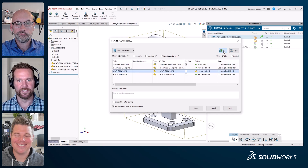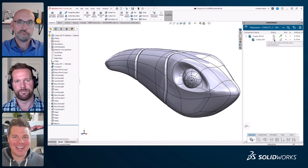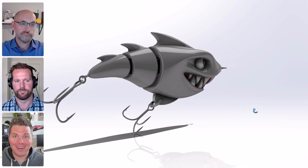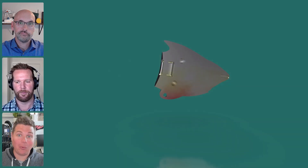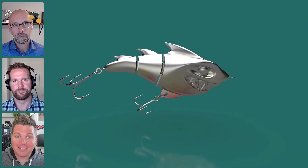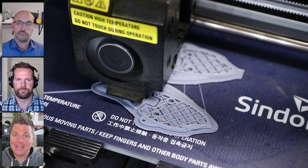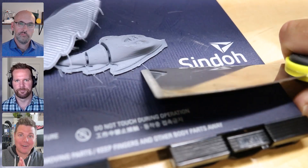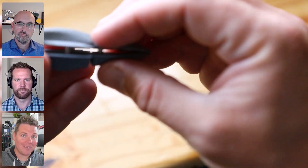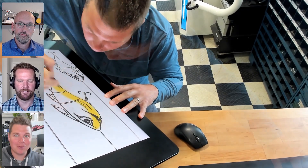As soon as Jason wrapped that up, he took it a step further and decided to manufacture the model. He went right to the 3D printer, printed it in six pieces split down the middle, inserted three dowel pins, and used epoxy glue to pop it together. He even used some Bondo auto-filling paste on top to smooth the seam, sanded it up, and then airbrushed it with a clear coat.